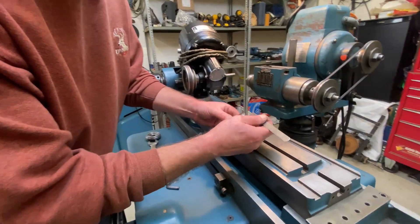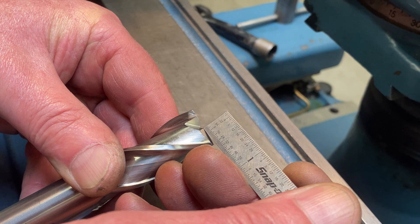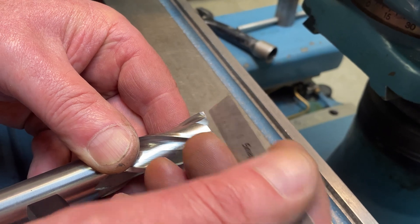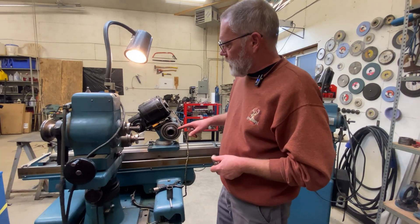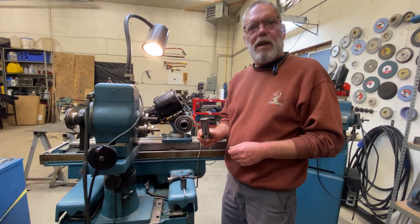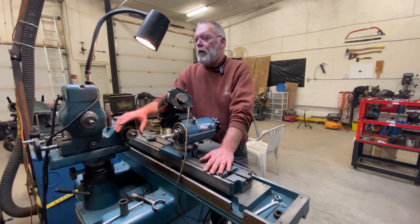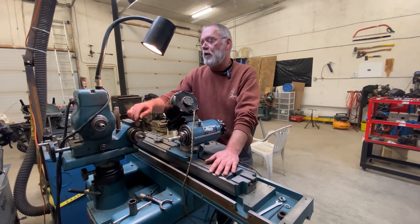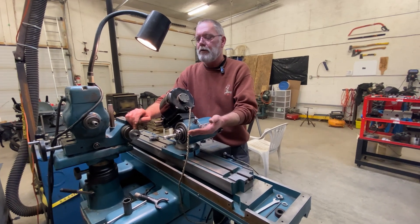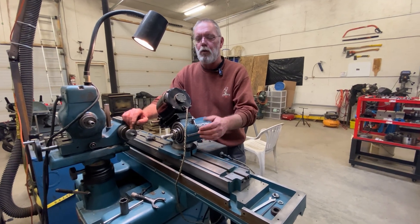We're going to come into our grinding wheel and put this 3-degree angle on this tooth here and blast this back until we get rid of all the damage. This work head has a Brown & Sharpe taper in the spindle but I have adapters that go from Brown & Sharpe to 5C, so we're using a 5C collet to hold our end mill. Center height is super important when doing a taper — I have my spindle dialed in exactly at the same center height as my fixture, because if I want a 3-degree angle as set with my fixture, the center height has to be right or it'll get all buggered up.